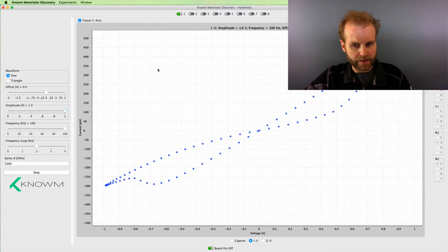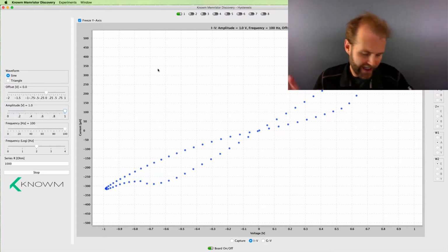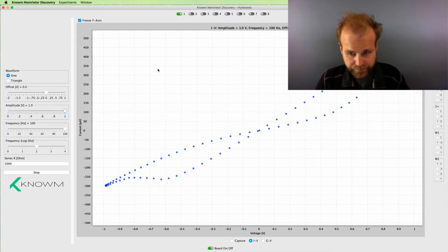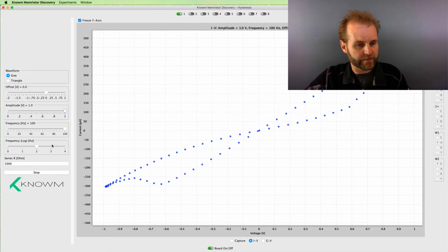It was about reducing that series resistance, getting a bigger voltage drop so we can just hammer those ions back across, get the thing unstuck. So the lobes have opened up, and we now have a memristor. Okay, so this is good. We have brought it back from the dead.